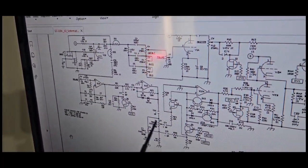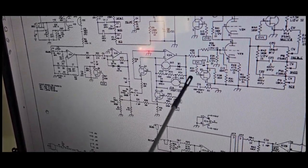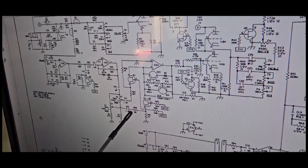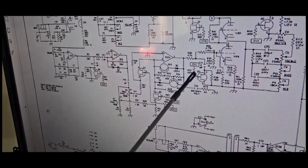When it comes out of that, it's going down to this volume knob here, the gain knob, which is bringing in all this transistorized section. That's where your gain 2 is. That's why the gain 2 can be so raspy, because it's all 100% solid state driven. There's absolutely no tube in that at all. So gain 2 is more solid state.